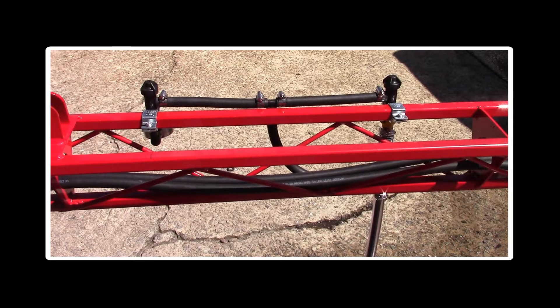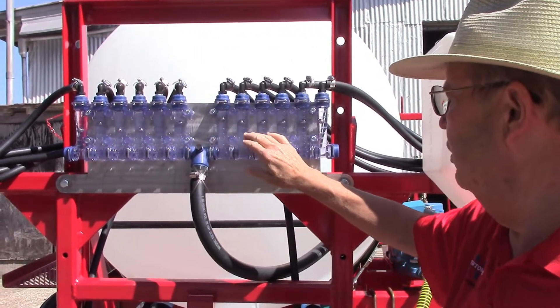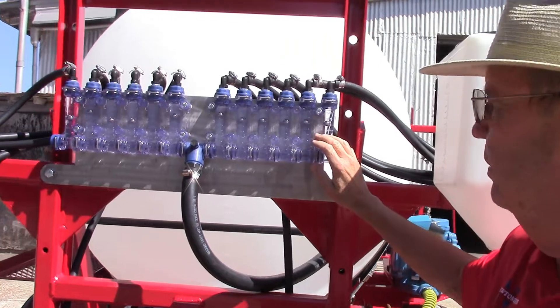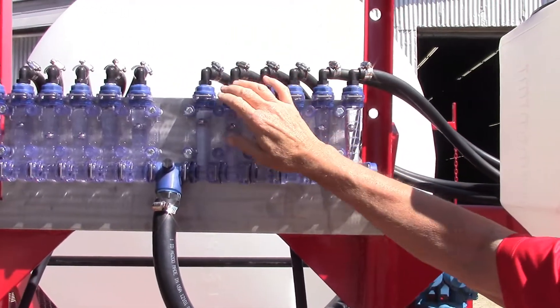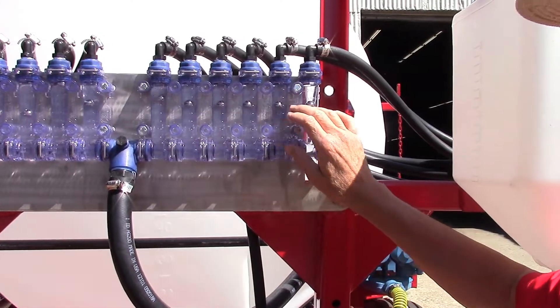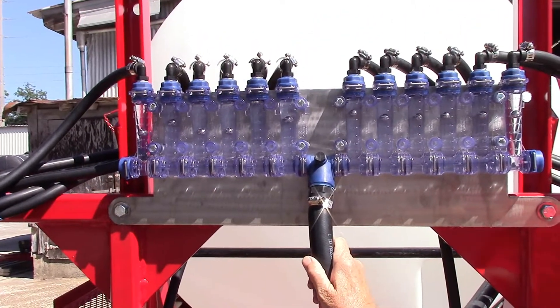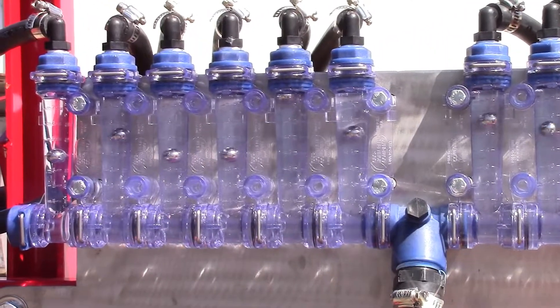This is a 24-row unit. On one side we see here each nozzle; two nozzles are represented to each visiflow. You can see they're relatively the same. On the other side, the visiflow is doing what it's supposed to — showing problems.